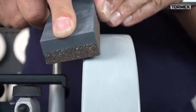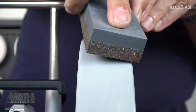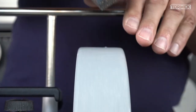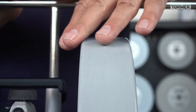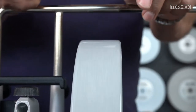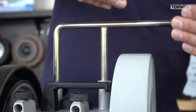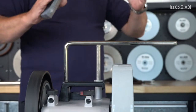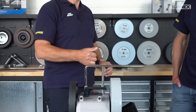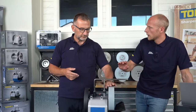The bigger the radius you round off, the easier it is to sharpen. I've already made the preparation - it takes about two minutes to grind it round. You'll lose about two millimeters on each side horizontally but that's not affecting straight knives at all. It's also more forgiving if you come with a straight knife at a slightly diagonal angle. To remove aggressive edges you can use the TT-50, or if you prefer, leave a little roundness.